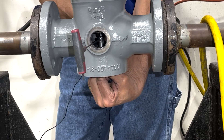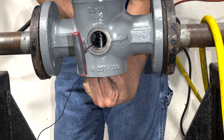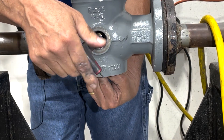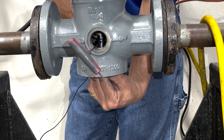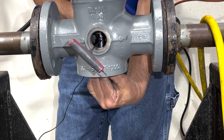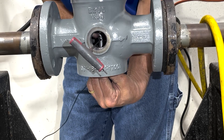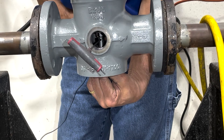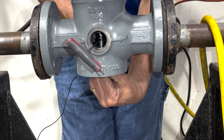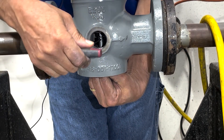This is one of the reasons why I did not want you to connect to the diaphragm at this point, so that you can get your adjustment right. It takes a little bit of work — make sure that your set screw is loose enough and keep your wrench in there so you don't lose your window for adjusting. Once you have made that adjustment and both seats are firmly seated against the orifice, you can tighten your set screw and your adjustment should be good.